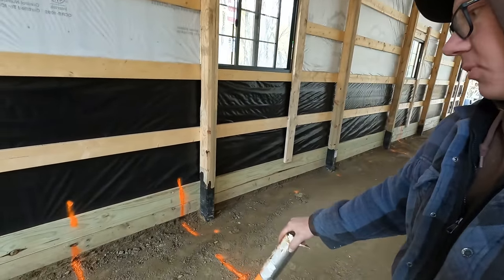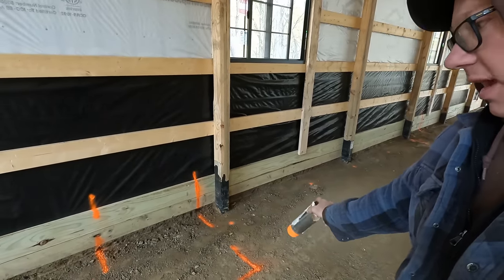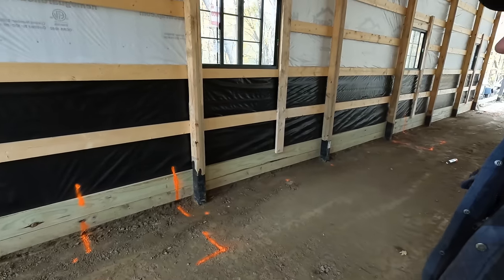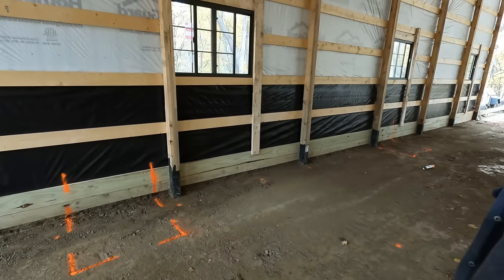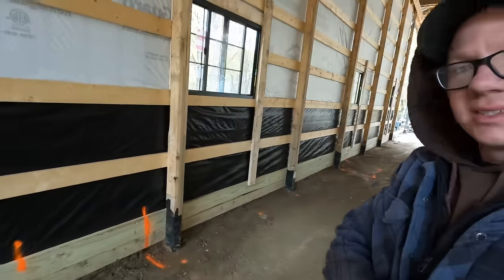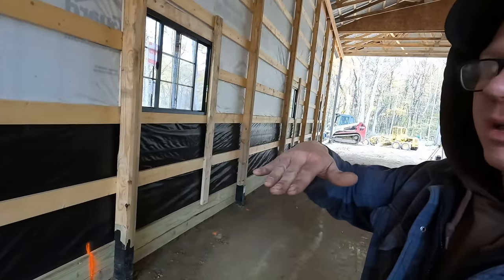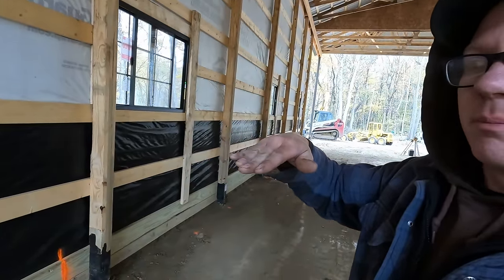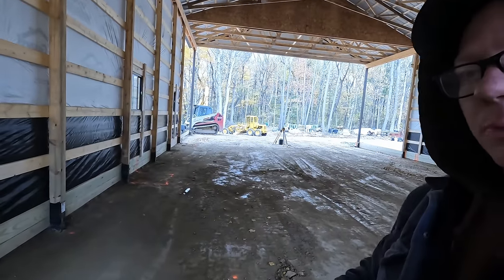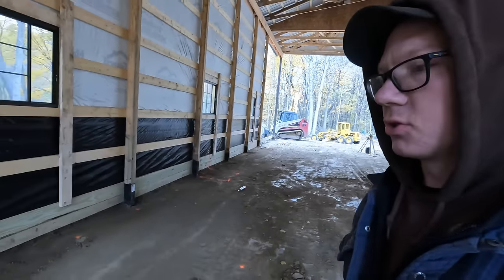This is a 3x3 square, and we're gonna dig that down 3 feet deep. I'm gonna build a rebar cage down inside of it, and we're gonna bring out some rebar and anchor it into the slab. We're gonna pour this slab as a sleeper slab. So what that means is that this pier, the finish height of it, is gonna be just above the bottom of the finished floor concrete. So that way when you come through and you pour your floor concrete, it's gonna tie right into that thing and take a hold of it, and they're gonna join forces.